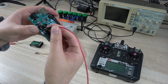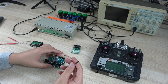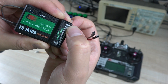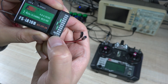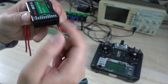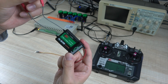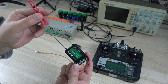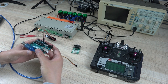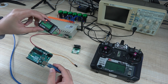The red is 5-voltage and this is GND, so I connect to this receiver module. The top is VCC, the power supply — you can see the VCC is in the middle and on the right. This is VCC and this is GND. This is the antenna for 2.4 GHz. So we use the USB cable to connect. You can see the red LED is on the receiver board — it began to work.